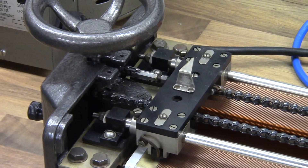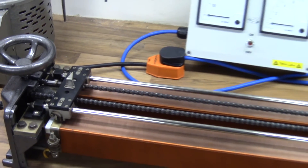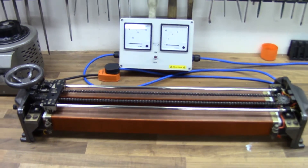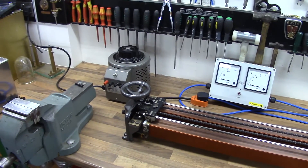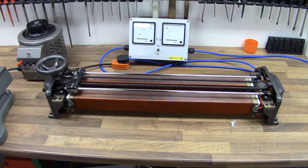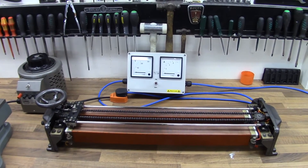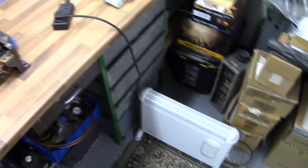I've taken the covers off the Variac and plugged it in a different arrangement for load testing. The rotary Variac over the corner is supplying 250 volts mains into the linear Variac. Out from the linear Variac we're going into the power meter — volts and amps — and then out from there down to the 2kW heater. So we'll be load testing at around 2kW.